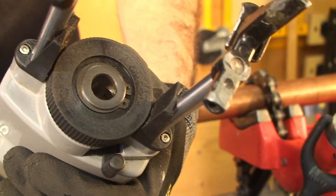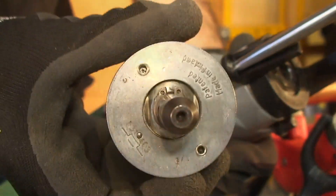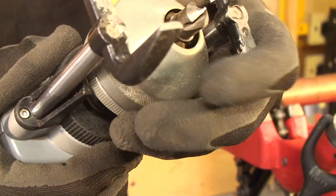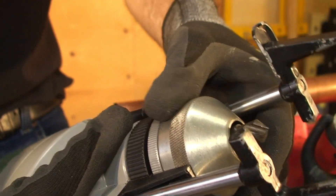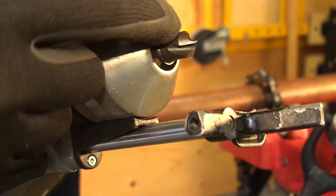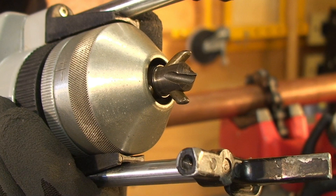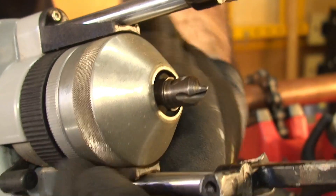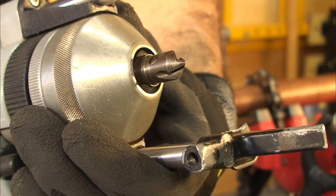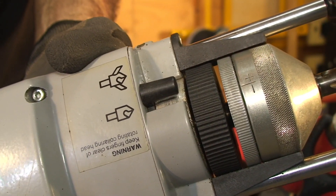Because we'll be recreating the prefabricated inch and a quarter by three quarter inch manifold, we'll be inserting the three quarter inch extrusion bit. To do so, we simply turn the T-drill's collar, drop in the extrusion head, and return the collar until the extrusion head locks in place. The extruding teeth should be retracted inside the drill bit each time you commence drilling. If the teeth are extended outward, simply press down on the extruding head and turn it until the teeth are retracted. Also make sure the extrusion switch is in the retracted position, which will allow the two forks to retract inward as well.